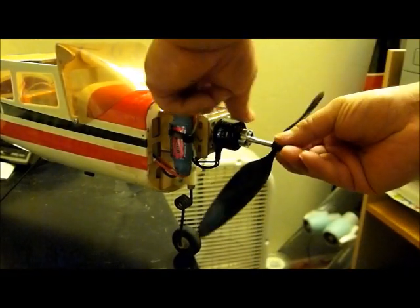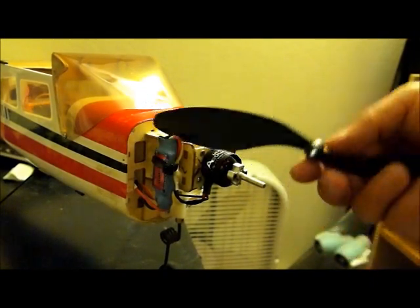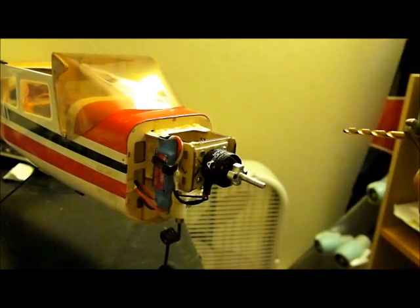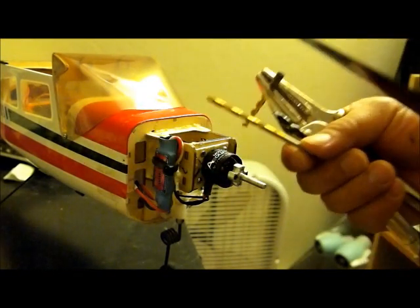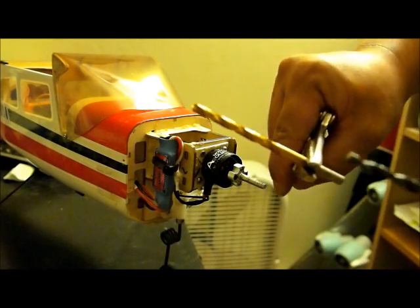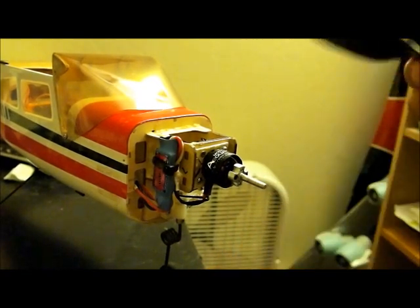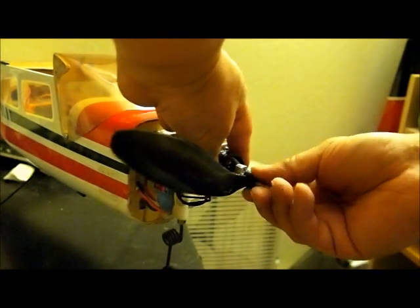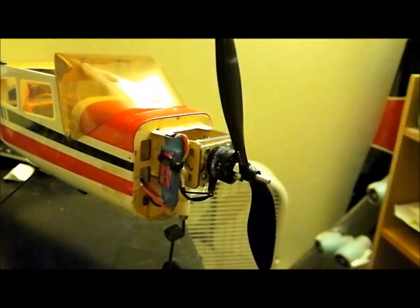I can tell it's still just a little bit too small. So I ended up drilling off camera — starting with the smallest one, then the next size up, the next size, and finally to the one that actually fits. If you slowly drill through and go size by size, you'll get there and it should be pretty straight.